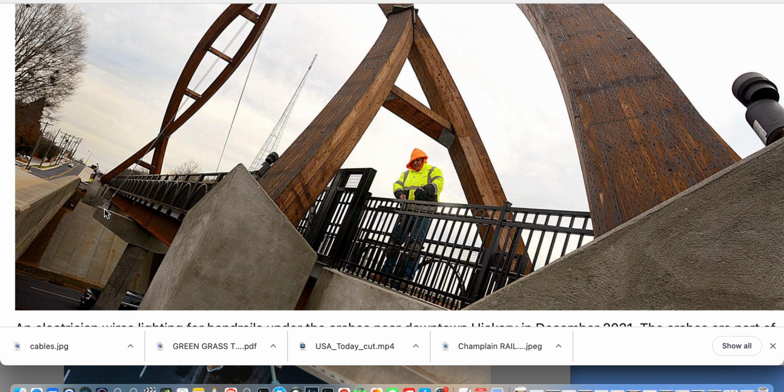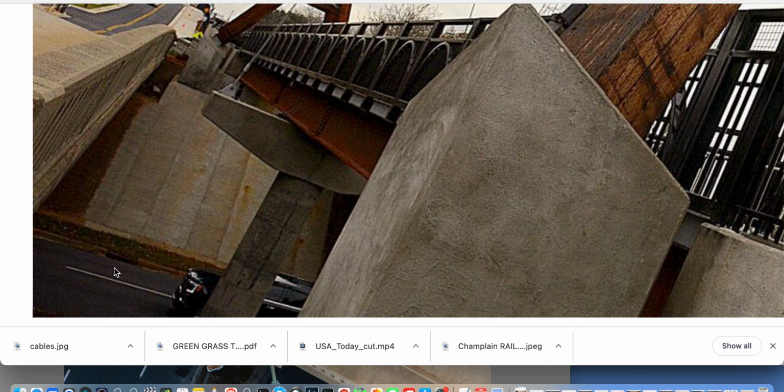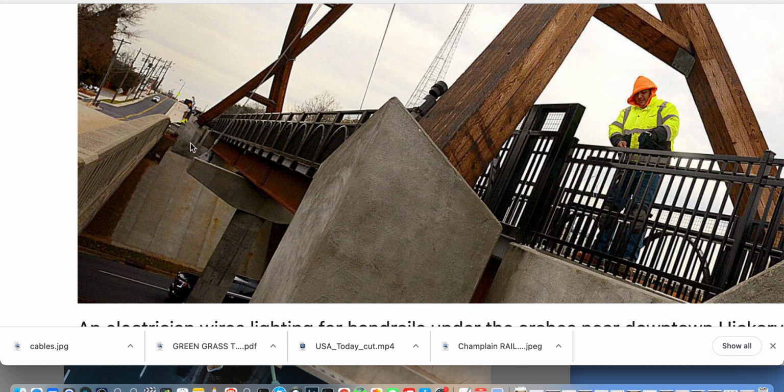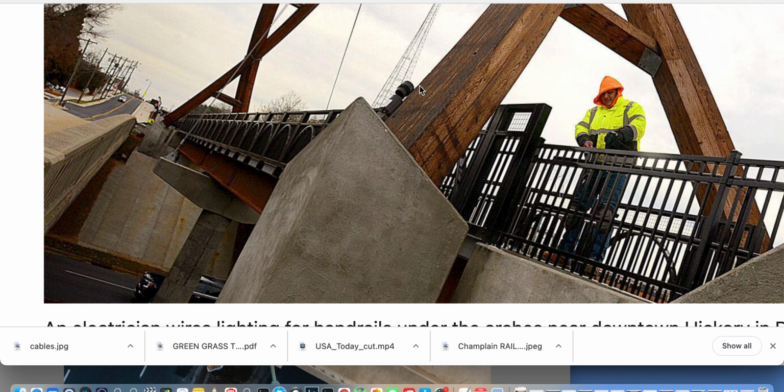Okay. There are the tie downs. What's this? Down gutter. And it's like it was added to this abutment. These guys engineered and added to the top. Here's a little pier cap. Little hammerhead design. Is that a hammerhead? And so that would have a lot of steel down the bottom also to stop it from wanting to pull up. So the steel reaction would be in here. They would have a lot of steel going this direction to stop it from wanting to pull upwards. And this is just in compression.